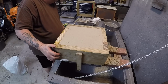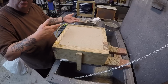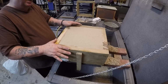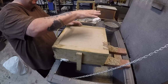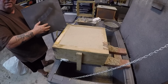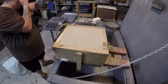All right, now, oh yeah, next thing, I'm now ready to put the bottom board on here and then flip this over and continue on, right? Well, you need to have a way for the gases to be able to get out of here other than the natural permeability that you have, because remember, this is going to be sitting, its entire weight is going to be sitting on a bottom board. The bottom board in this case is this. Now, I don't see a whole lot of channels in here that's going to allow the free passage of air. All right, so, and we're in this case vapor.